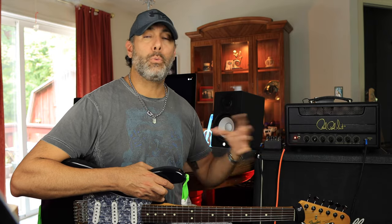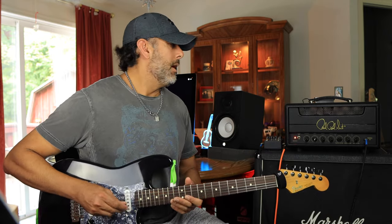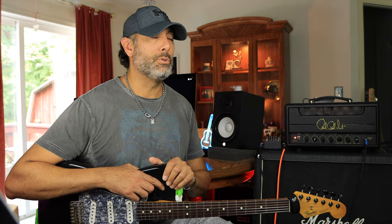I find that the bass, mid, and treble tone stack is effective but not extreme — anything on the dial is basically usable, which is really nice. It gives you the push you need in the bass or treble to get a little more gain. The master volume works like an attenuator — set your tone and gain structure, then use the master to dial in the volume you want for the room.